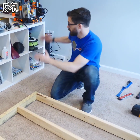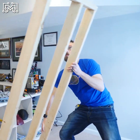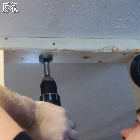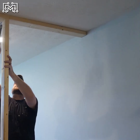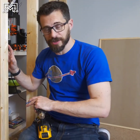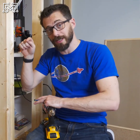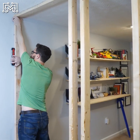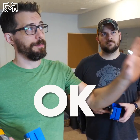I've got the small section of the wall — it's gonna go right here. So now we're just gonna stand this thing up and slide it into place. We've got the two sections of the wall up and locked together. They're also tied into the joists above and the stud in the wall. Now we've got to tie them into the concrete.